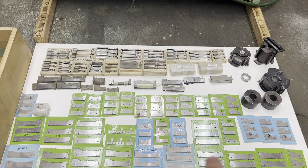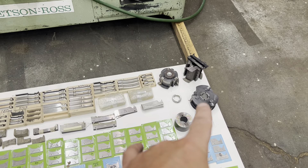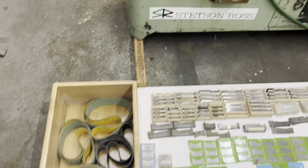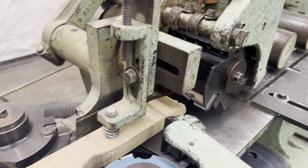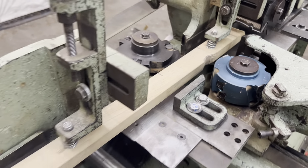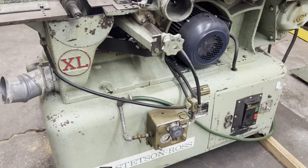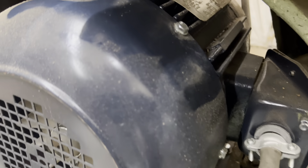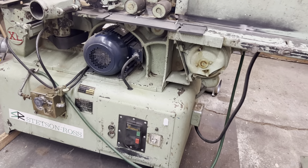You can see all of this here is brand new. There are one, two insert heads there, three insert heads — that's all they ran on this machine. There's a bunch of belts and two more insert heads on the machine currently. It's an inch-and-a-quarter spindle machine. There's another insert head here and a little helical head. It's a push feed molder — three horsepower on the side heads combined, looks like 10 horsepower on top and bottom shared, and variable feed speed on the infeed.